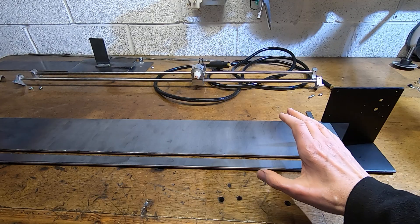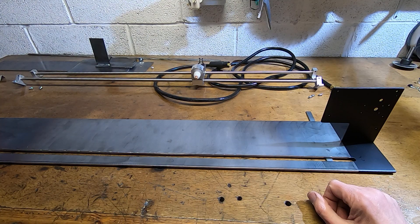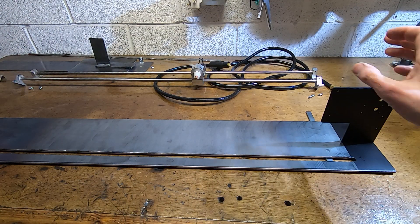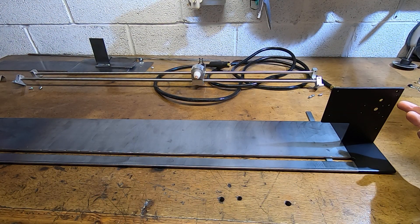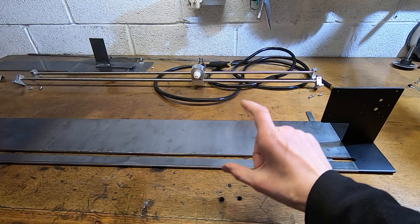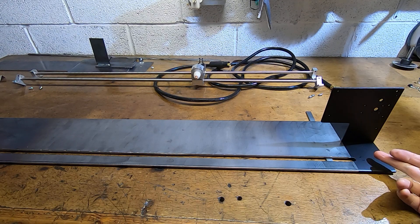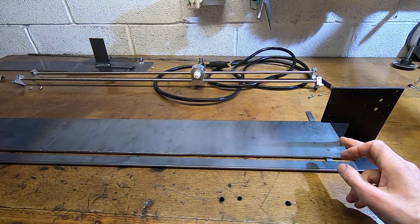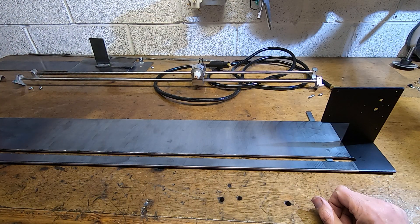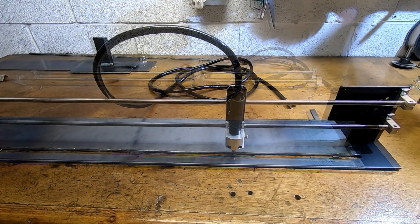As you can see it's all painted and ready to start reassembly. I fitted a brass grounding terminal at the back. The first step is to put the rails on — I'll attach them and get them adjusted so they are the same distance apart at both ends, so they don't nip up the carriage as it slides along, and also make sure they are at the right height so the torch doesn't go up or down as it moves across.